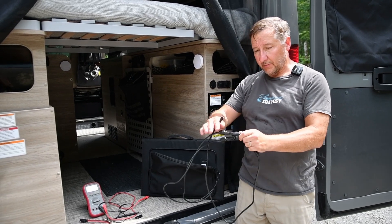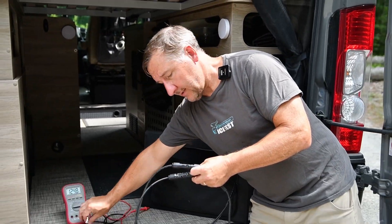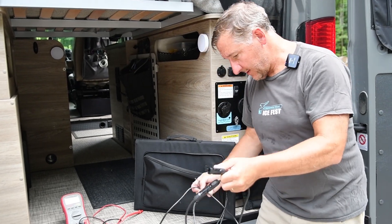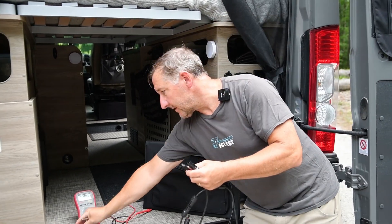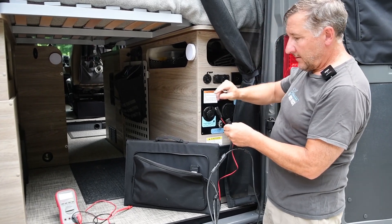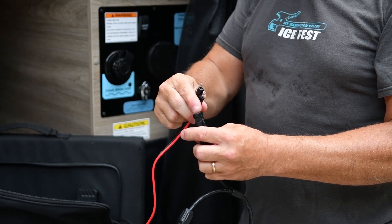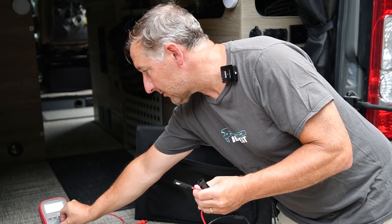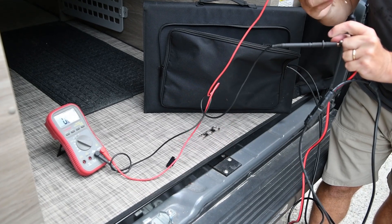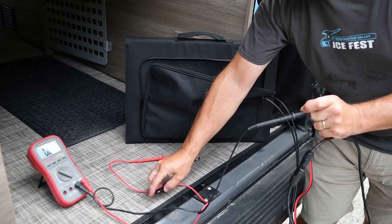I have the MC4 connectors that come from the solar panel — one is marked positive and one is marked negative. I'll disconnect the positive using this little tool and test it. I'm going to switch to measuring ohms for continuity. Putting one probe in the black top port and the other on the connector inside — that is not connected. That confirms it was the negative plugging into the positive terminal, which is what we suspected.